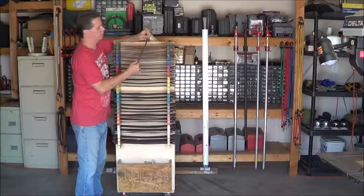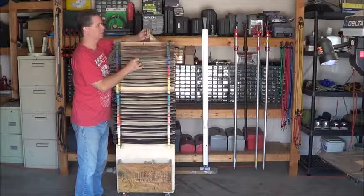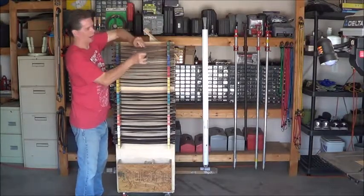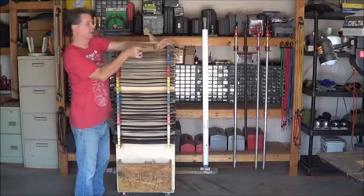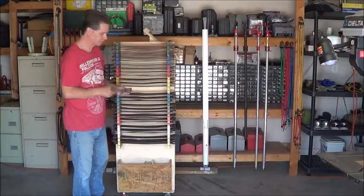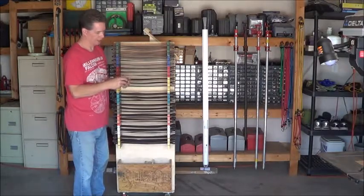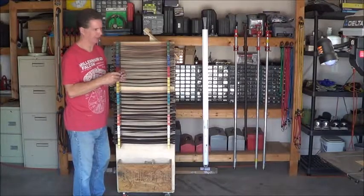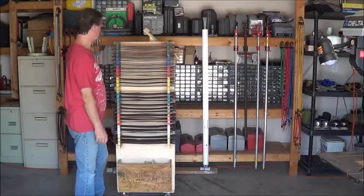And these are really good if you're working on the lathe and you want to do a little bit of polishing or sanding of a part on the lathe. You can simply wrap it around the part while it's turning and put a little pressure on it like this, and it'll give you a nice even sanding of the part. So it's good to keep these around. Sometimes these belts break and they're still really fairly good. You can repair them, but it's nice just to have them around as a strip of sanding paper.